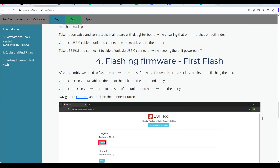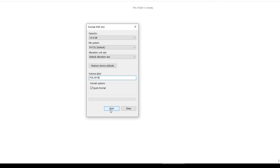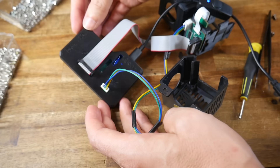The main board has its own two-part housing. We start by inserting some M3 nuts to be trapped in the underside, then M3 bolts go through the PCB and into the nuts to hold it in place. The lid for this enclosure is a satisfying snap fit. The website shows the correct orientation for both the power and ribbon cables, so double-check them to avoid letting out the magic smoke. At this point I chose to do the firmware — we simply format an SD card, place two firmware files on it, and install it into the main board.